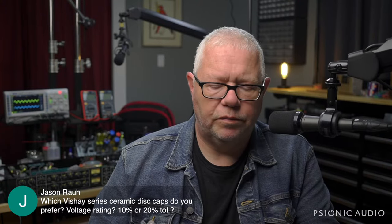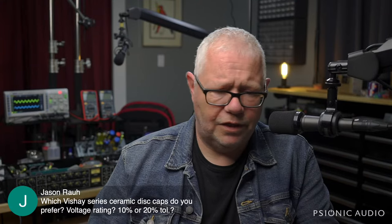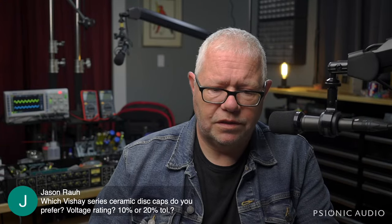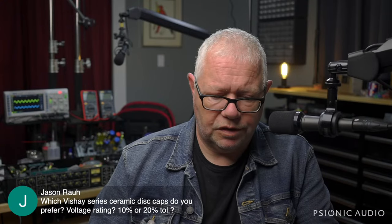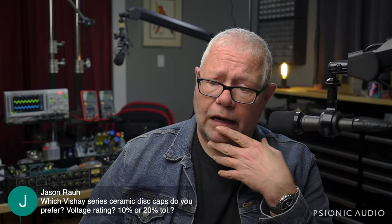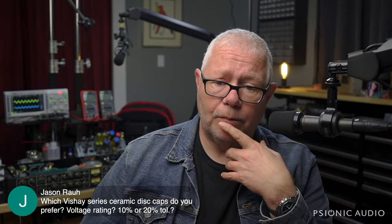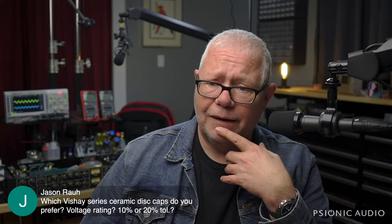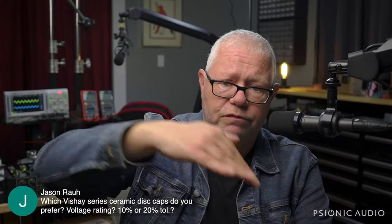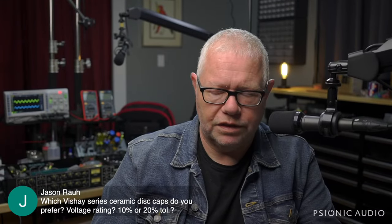10% is usually just fine, but if I have a cap where everything else is where I want and it's 20%, that's usually fine as well. Honestly, the way that we use small value caps in amplifiers, 20% tolerance is fine. You're not going to hear, oh, I wanted a high pass at 1.2K, but that's clearly 1.1K. We just don't hear that way. There's so much overlap. It's not a hard and fast thing that just shelves everything directly beneath it. There's a fall off, you know, so I'm not making fun of you with that voice.